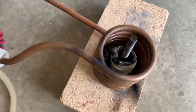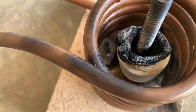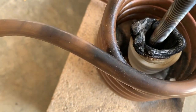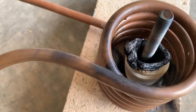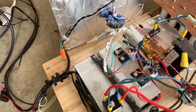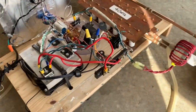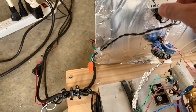Okay, induction heater set up. We're going to test this bauxite crucible containing a starlight crucible inside it that I've carbonized, and I've got a metal rod in there. The induction heater — I actually got rid of the capacitor bank, because with a full bridge induction heater like this one you don't really need to have it. Now I'll adjust the current setting so we have maximum current.